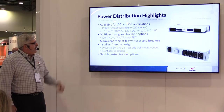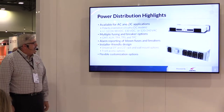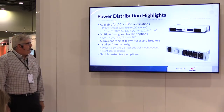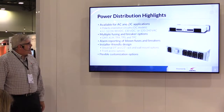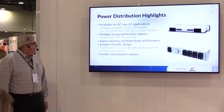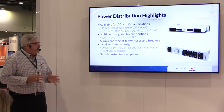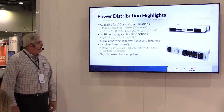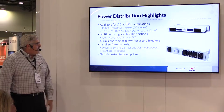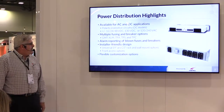The two different categories of products: the top product is a DC distribution panel. It supports 12, 24 and 48 volt plants. There are a variety of different types of fuses that people use — GMT, KLM, TPA — they are all basically using different ranges of current that they can pass before they would blow. All these products are 19 or 23 inch rack mountable or can be mounted inside a cabinet, and we have quite a few options as you'll see.